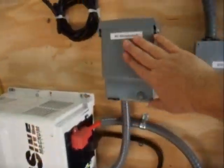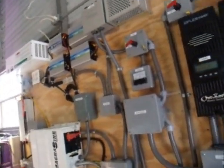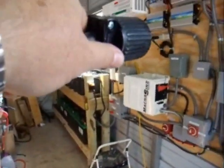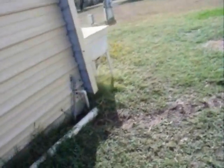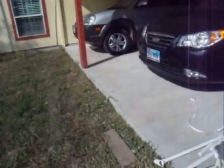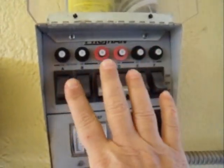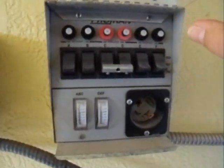What I'm going to do is change that AC disconnect and put another 30-amp plug in there. I already wired my power to the house with a generator transfer panel, and I have a connector that I'll be able to connect up there when I need to. I'm going to run that into a conduit that gets buried under the ground, coming out of the shed and going to where my power distribution panel is. It'll come up the wall to the panel, which is already wired in — that will feed my house if I ever require power from an extended outage.